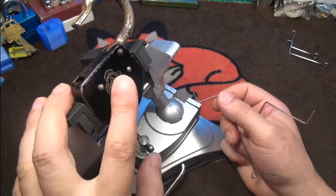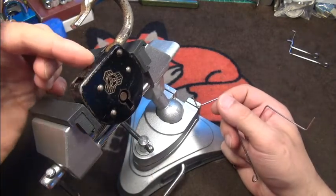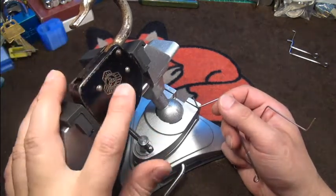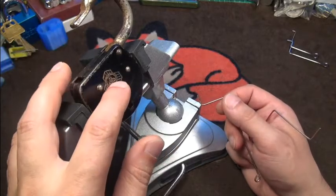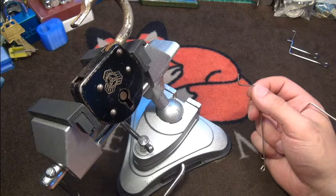Sometimes I get only a tiny little click from the first lever - which you count from the back, so here's the first, here's the second. You get a tiny click from the lever which is binding first, and then a click from the front lever, and then it opens.